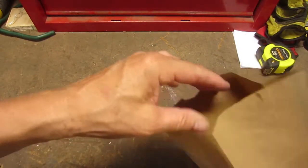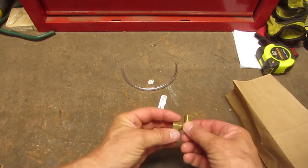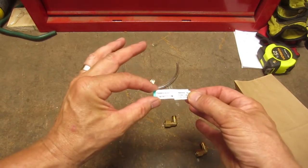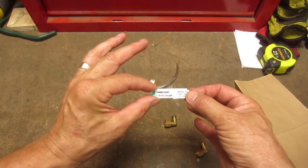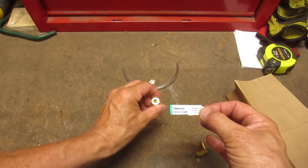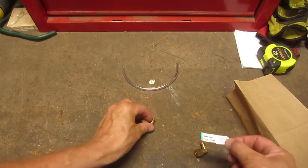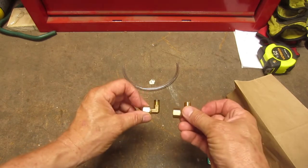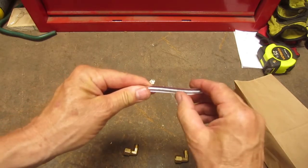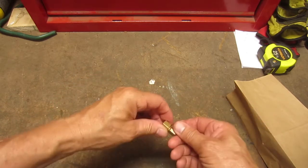Back from a quick trip to the hardware store — none of this stuff is hard to find. So this is what I bought: two of these fittings. That is a five-sixteenths by one-eighth inch fitting. The eighth inch is a pipe thread that goes into the Bobcat, and the compression side is what's going to be used for my gauge tube. These were $4.79 each. And then I've bought a length of plastic tubing — this is five-sixteenths OD — and it'll work with these.